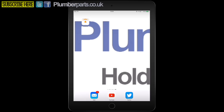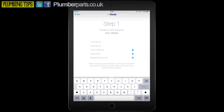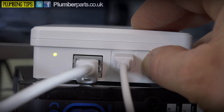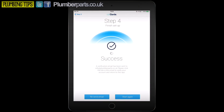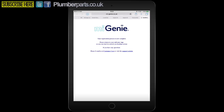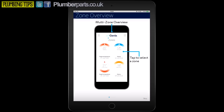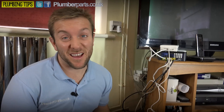So now we open up the MyGenie account. All we need to do is create an account — nice and easy. Just ask your customer to fill out their first and second name, an email address and a password. Now just ask them to pop in their house name or number and address. Now that we're setting up, we just press the button on the gateway just here — you should see the LED will start flashing green as soon as the button is pressed. As soon as these two are talking together and you've got this lovely little success screen, you'll get an email sent to your email account for verification. The email says: 'Hi James, you're nearly ready for the magic to begin. Simply click the link below to confirm your email address.' So we're going to confirm that now. As soon as you've confirmed your email address, just pop over back to the MyGenie app and we're ready to use the controller. You've got all the instructions on how the control works. They're now talking to each other nicely. We've got our system knowing the temperature and everything that's going on in here. It's so easy, and it's really good as well — it updates the system and it is the way of the future.